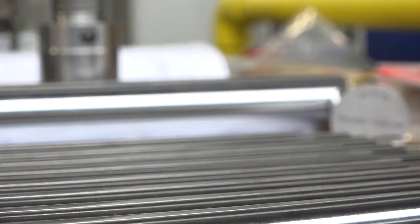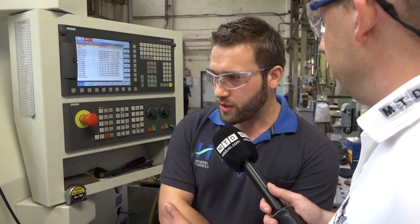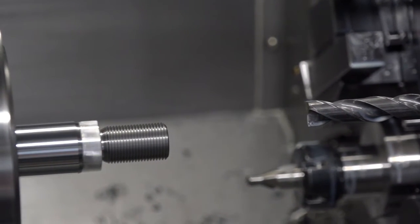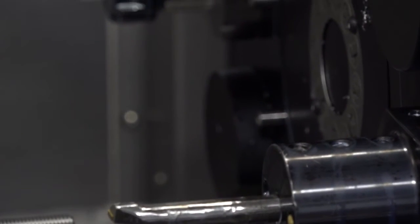That's not an easy material to machine either. That is a hard chrome bar, which does take a little bit longer to do. It doesn't chip very well. We just use standard oil-based lubricants and pink cutting fluid. The machine handles this type of hard chrome perfectly — it does well with it. We've changed our tips recently, which have helped the process and sped things up.